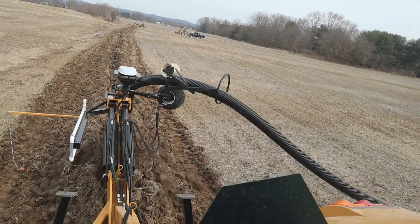We're pulling six-inch and going pretty deep — I really don't think we'll need a tractor to pull us on the laterals. A lot of people ask why we didn't use the John Deere, or why we thought the 1038s would do better. These guys informed us that tall skinny tires are really what you want — versus floating on top, you need something to cut down into the ground. With the tires on the John Deere right now we'd be slipping a lot more. It has more weight but probably less PSI to the ground, which is good for field work spreading out compaction — but we really need the ground to get compacted briefly before we shatter it with this shank. When you're pulling a tile plow it's the exact opposite of farming: you want as much compaction as possible, and when you start to slip you slow down. These CVTs are pretty nice — we can dial in the exact speed we want, whereas with the John Deere one mile an hour in first gear at full idle is as slow as it goes.